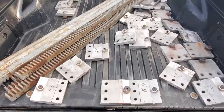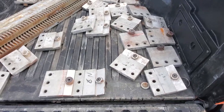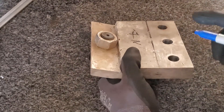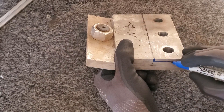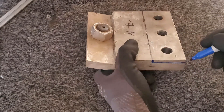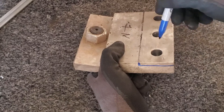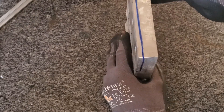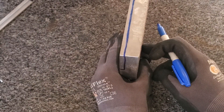The plant asked me to make a relief cut on the backside. I brought half of them back with me from the plant — there's a total of 64, this is about 32. They were so kind as to scribe a line where the bottom edge of the support structure is. Basically we're going to take and machine a quarter inch deep step across this entire surface, removing all this material so that when the piece mounts back on its surface it's sitting outboard — moving a quarter inch outboard to hopefully alleviate the scrubbing we're seeing on this inside face.